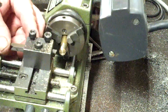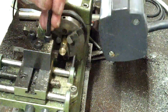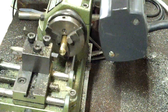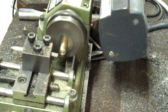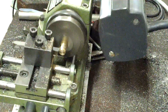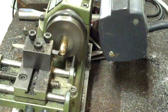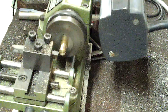Now let's go ahead and install the 10-degree tool that's got a little bit of a point to it. Backing off to 1,100 RPMs here just for the observer. Let's go ahead and go in — four thousandths.